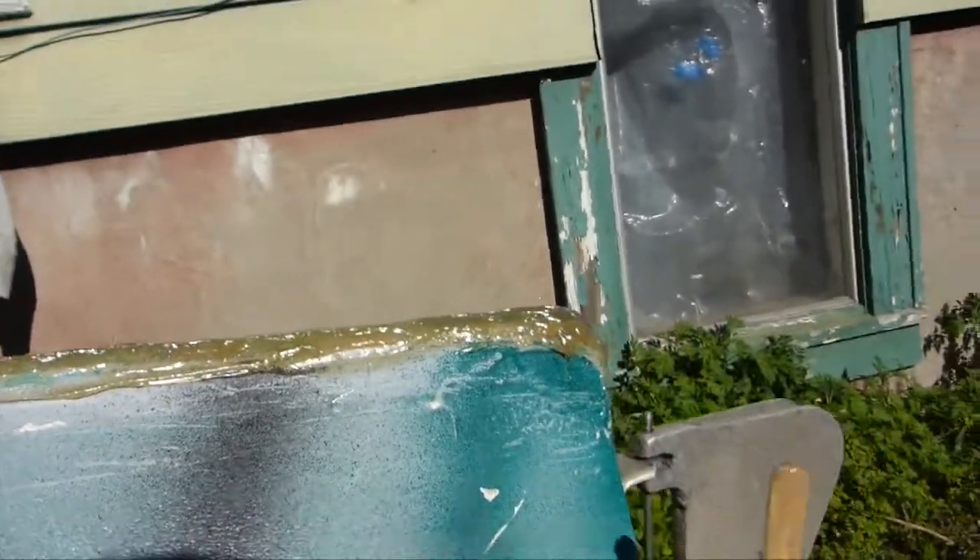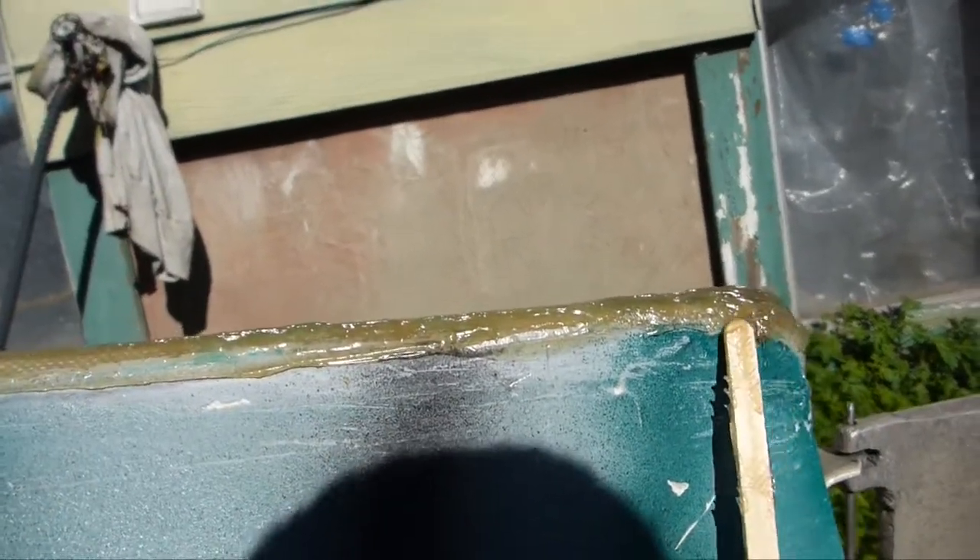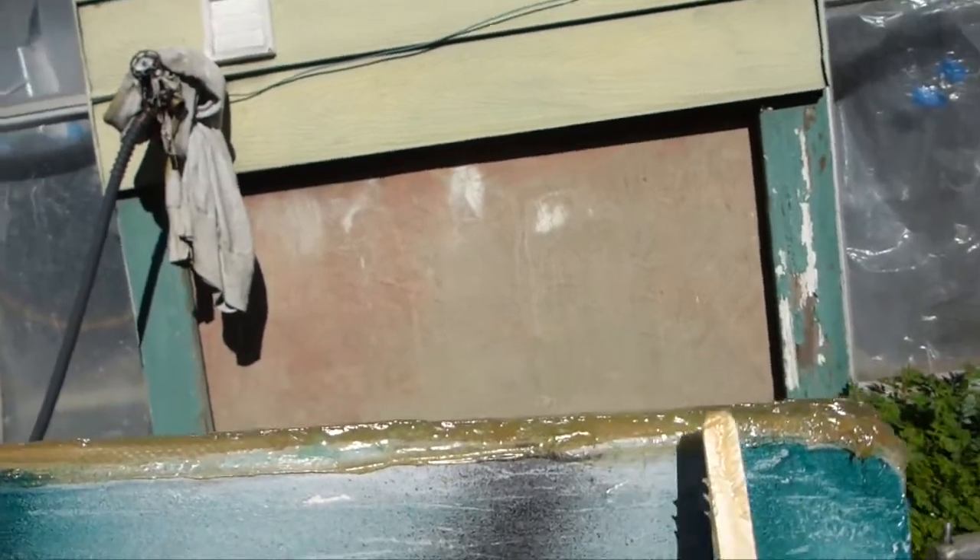The stuff's so thick that I can actually layer it up like Vaseline. Of course it's not going to be very pretty at this stage — I can go back and sand it later. I'll let this cure overnight. You can see the patch right in there. It's not very pretty, but it's inside the boat and I'm not that concerned about it. It's basically a thickened-up piece of resin that's hopefully going to stick over there and patch up that leaky hole.